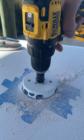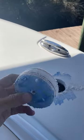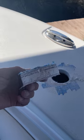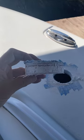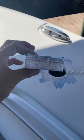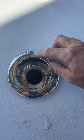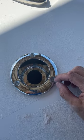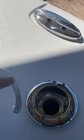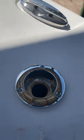It's hard to do with only one hand, but there you go — hole's drilled. As you can see, I got the plug out. It's thick, but there's not much to back up if you just put sheet metal screws in there. I really want a backing plate, especially putting a shade sail where there's going to be a lot of tension. I've got the cup rod holder laid in the hole for dry fitting. Now I need to pre-drill each one of these holes — I'm using quarter-by-20 screws. The backing plate already has the nuts incorporated into it, and I want the hole just a little bit bigger than a quarter inch so the screw has a little play. I'm going to pre-drill these.